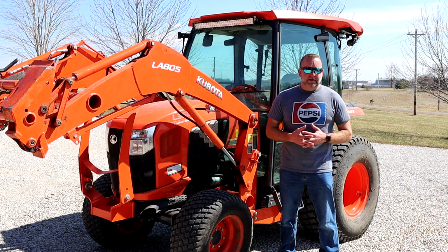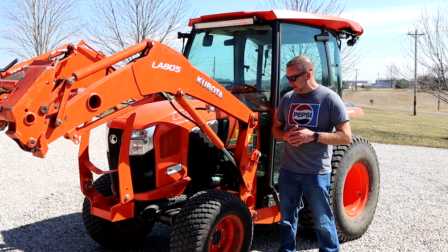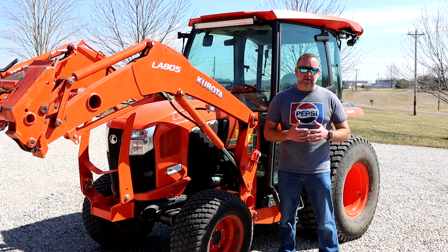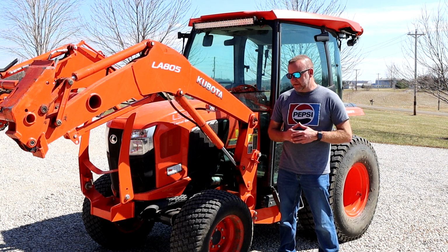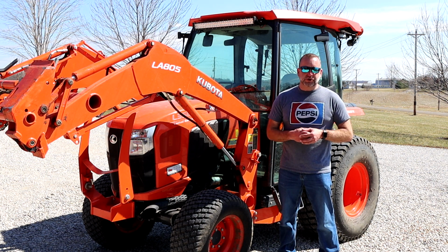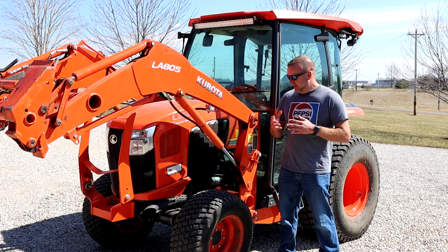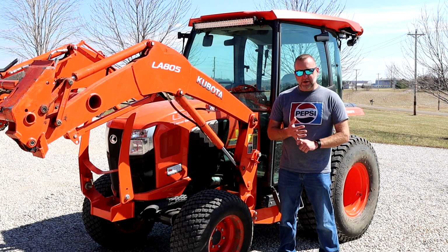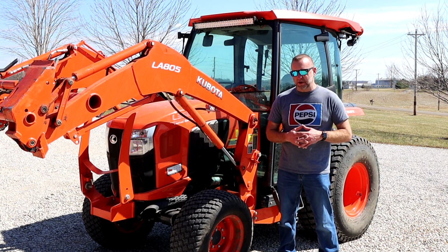All right, everyone. Today's video was super short, simple, and hopefully helpful and clears up some questions that people may have about their front axle fluid. So once again, could it be the dealer's fault? Absolutely. Should you be quick to blame them right off the get-go? Maybe not. So check your fluid, do it when you get your tractor, do it at 10 hours, do it again at 50 hours, and then you should be okay.